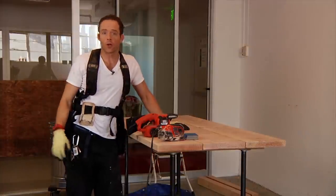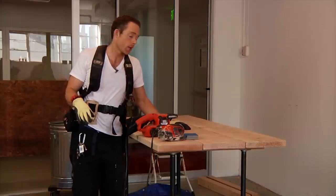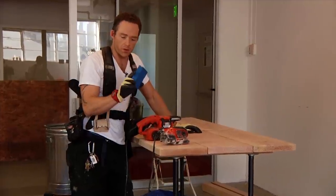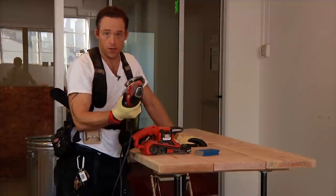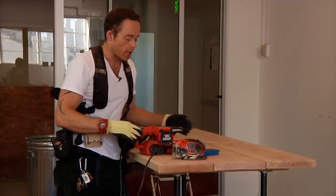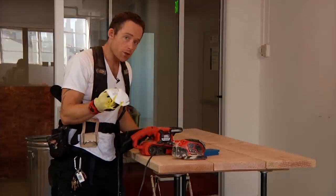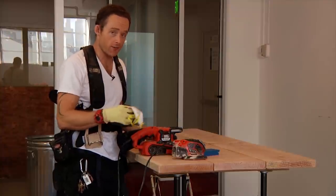We've got our table outside in the main part of the studio — you want to always stain and sand in a ventilated area. You have a couple of options with sanding: one is traditional hand sanding with a sanding sponge, which you can get in a variety of grits — this is 80 grit, a pretty heavy grit. You can also do a palm sander, which is fairly inexpensive, or upgrade to a belt sander — a big 3x21-inch sanding belt that will take care of this thing in no time. Always wear a mask when you're sanding.